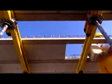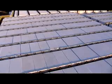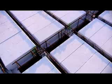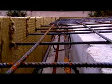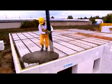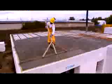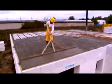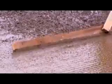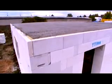The laying is very easy and quick. Reinforce the upper part of the plate with concrete mesh. Put the beam reinforcement in the gap between filler blocks and the beam blocks along the perimeter of the floor construction. Then, concrete the ribs, the beams, and the floor plate. Do not remove the laying support until the concrete is thoroughly set.